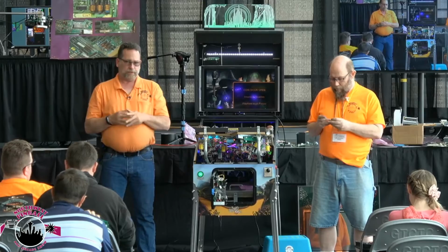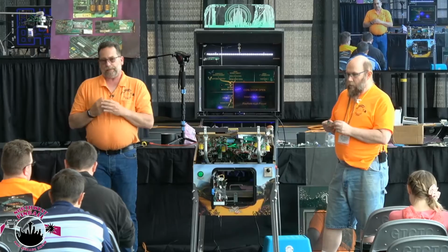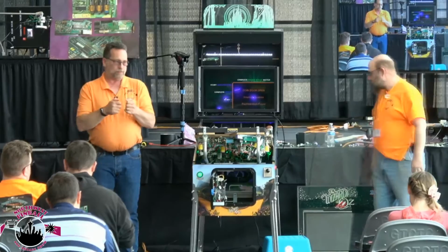Not to be supporting one of our vendors, but Rob Anthony of Lockwood Nut is a really great guy. He has one that runs for about $35 or $40. It's probably the most expensive NVRAM out there, but it is switch selectable. If you need it as a 5101, you flip the switches. If you need it as a 6116, you flip the switches.